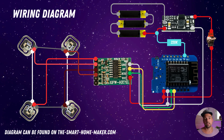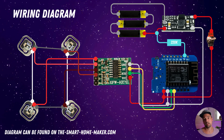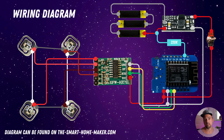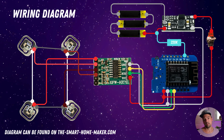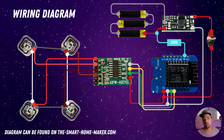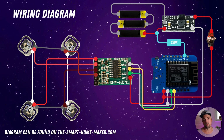First of all, we have to wire the 4 load cells. You can see in the picture how to wire them. The white connections in the picture correspond to the white wires coming from the load cells. The kind of grayish connections on the picture correspond to the black cables coming out of the load cells, and the different reddish connections correspond to the red cables coming from the load cells.